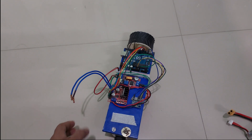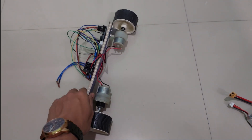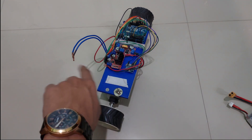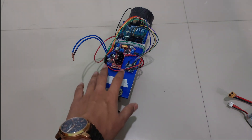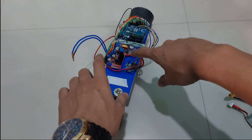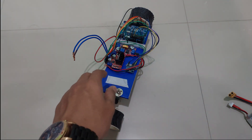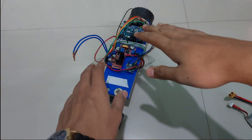I recommend a mounting system like this for the battery so you can fine-tune its position. Naturally my system is stable without the battery, but you want it slightly unstable so you can see oscillations — that's the whole point. Keep it a little off-center to see oscillations but fairly balanced, since these motors aren't very fast and the microcontroller has delays.